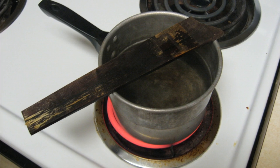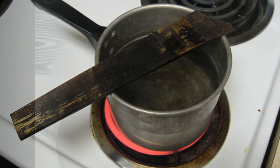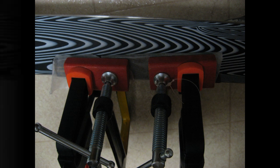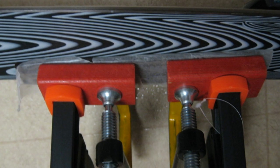Here I am steaming the board a little bit in preparation for straightening it. After getting it nice and steamy, I clamped it to a flat surface for a few hours. In this case, the thing to which I clamped it was a snow ski.